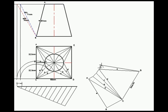The same now gets done with line C. I'm now going to determine line C. I measure the length of line C. We've already done the constructions here, 71. So I will measure the distance of line C from point D, measure that distance of 71, measure this semicircle part, measure it there, and join the lines to get line C. And we will carry on the same way with line D again, and then find the triangle.